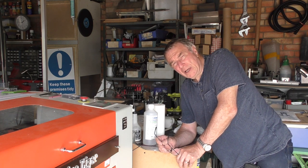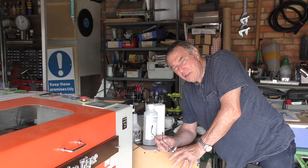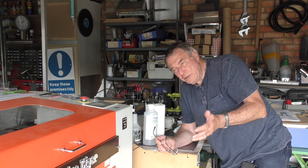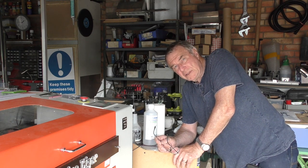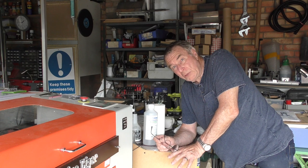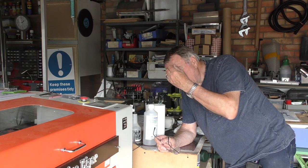Three people in particular have asked me about upgrading to a CO2 laser and whether the Nicky Norton white tile method works on a CO2 laser. I'm not in a position to fully answer that yet - I know it works because I've seen other people's work, but I'm not sure it's what I call proper photo engraving. For those transferring from a diode to CO2, there are significant differences between these machines. The biggest is the wavelength - the near UV wavelength is easily accepted by titanium dioxide, heating it very efficiently and quickly. The CO2 laser will heat titanium dioxide much less efficiently, slower, and with a bigger beam it'll do it in a cruder manner.